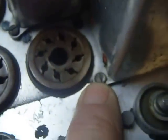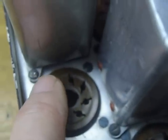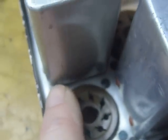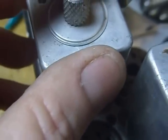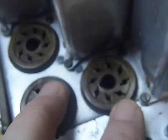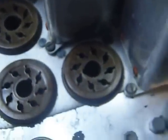Also, these IF transformers, the way they're mounted on these little screws is on these little riv nuts. And some of these IF transformers I found, two of them, were not making contact with ground. And if that's the case, then it's not a shield anymore. It becomes like an antenna picking up the signal from the others, and you got an oscillator. So those all have to be done. I have to go in there. I'm going to put little ground lugs on here. I'm going to put a ground terminal on here and run a wire for each one and ground each one. Yeah, it's a lot of work.